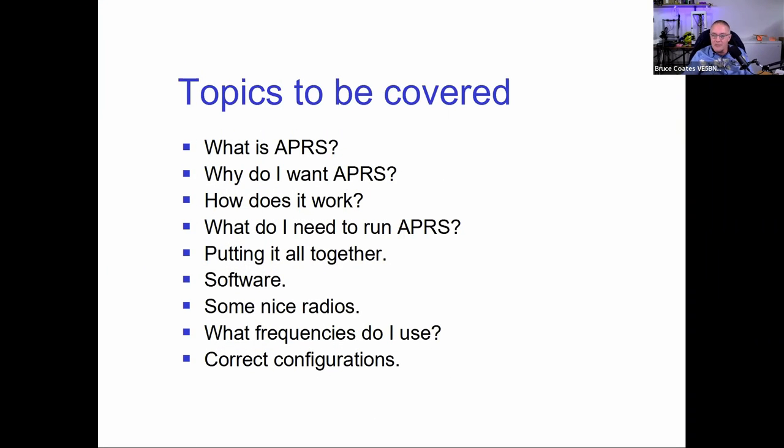So yeah, I won't cover all of these topics here, but I'm not sure how many people are familiar with APRS. That's kind of the ham radio side of what we do with the balloons. APRS is really an offshoot of packet radio, and in a nutshell, lets you transmit telemetry and, more importantly, position information over the radio. The locations are almost always driven by GPS. And for receiving it, nowadays, it's all pretty much done with software, sound card modems, whereas you used to use a traditional TNC in the past.